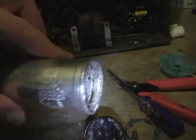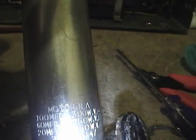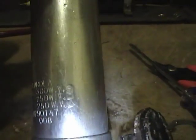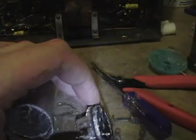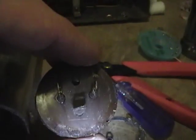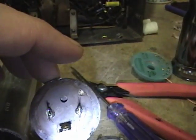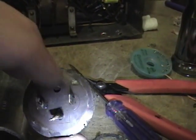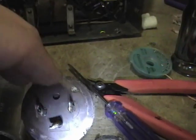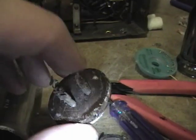As far as how I know what value capacitors to use, it's a legend on the can: 100 microfarad, 60 microfarad, 20 microfarad. There's a half circle, a square, and a triangle as identifiers, and if you look on the bottom of the base you see on the right the half circle, on the bottom the square, on the left the triangle. The can is the common negative. I'll feed the common three leads out this spare hole here and wrap the positive leads around each of these terminals.